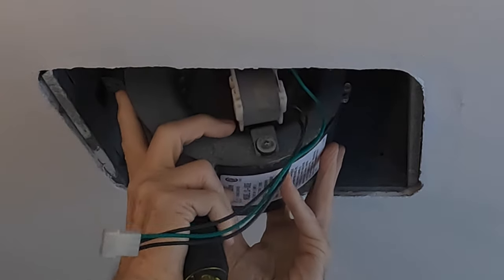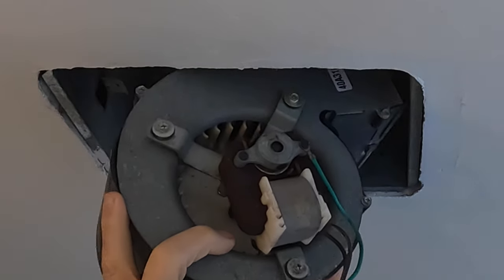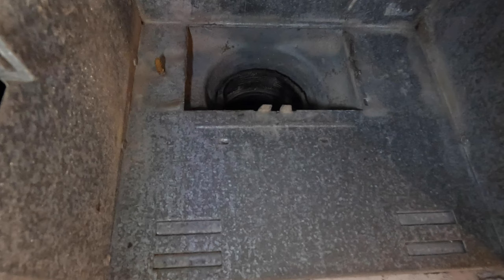And here it comes. There's the unit. This is the inside of the metal box that the fan goes in, and you see those two little nubs there where the arrow is — that's where the fan rests on that side, and then the other side has that one fastener that you saw me just take off. Note that this is a four-inch discharge and this fan is meant for eight-inch rafters. That's all important information if you were going to buy a new one.